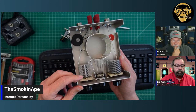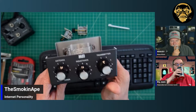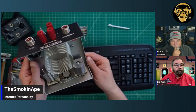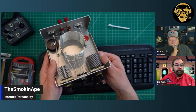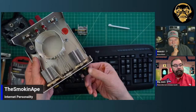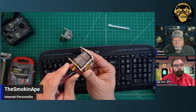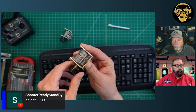Hollywood was saying MFJ labels their knobs backwards — higher numbers mean less mesh, totally counterintuitive. Here's the MFJ 901B: this knob is set to one, and this knob is set to six. One is fully meshed and six is pretty much fully open. Here's a two-gang capacitor — right now it's fully meshed, and if I turn it, it's fully open. The piece that moves is called the rotor and the piece that sits still is the stator.